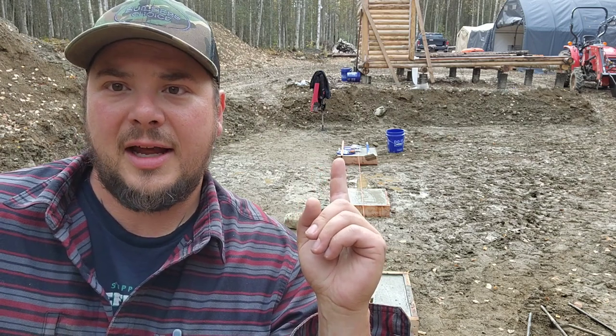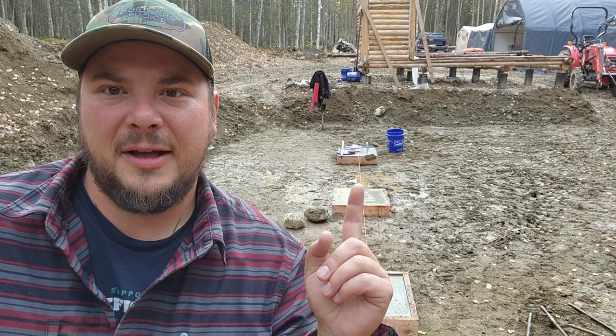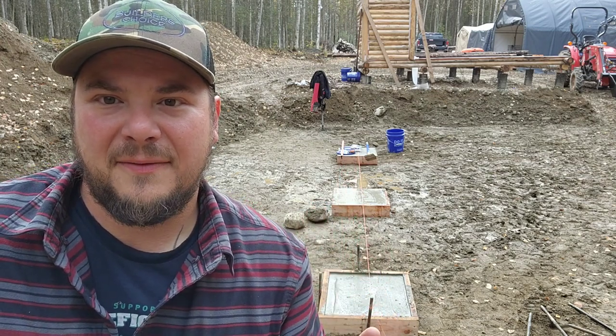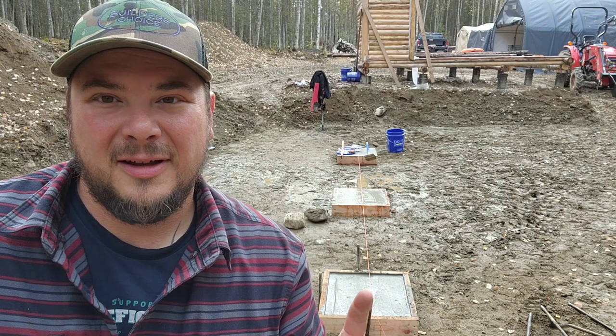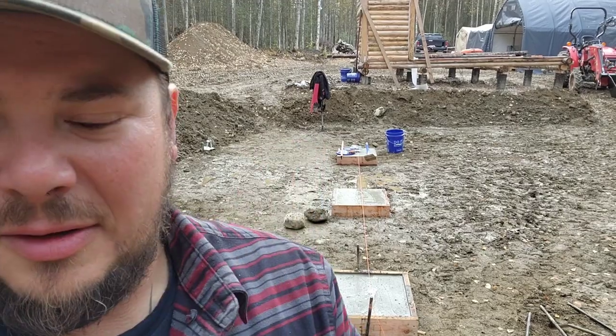Okay, so I string lined. That one back there is the one we did yesterday that's dry, and you can step on it and everything. I just showed that earlier. Now I put the adjustable cup inside it, and I've hooked the string line right to the cup, and I've ran it right down the middle of that one, down the middle of this one, and I've found my center mark based off of my square mark, because I put these three in yesterday, boom, boom, boom,